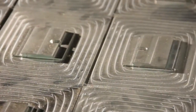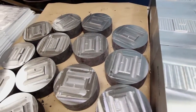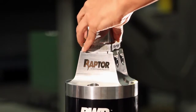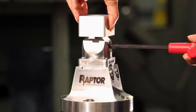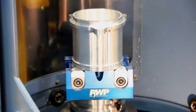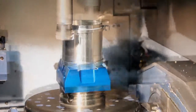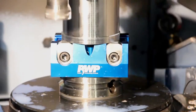You'll begin with prepping your workpiece by machining on a dovetail. Using the locating pin to center your piece, load the workpiece onto your fixture and tighten the spring-loaded clamps. This forces the workpiece into the solid shoulder and pulls the workpiece down. Now you have complete access to machine all five sides of your part in only one load.